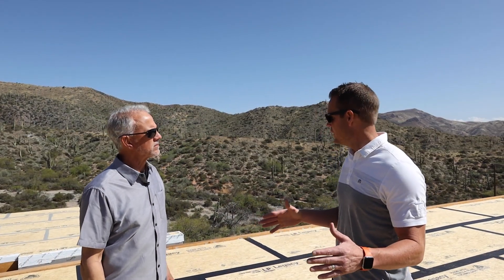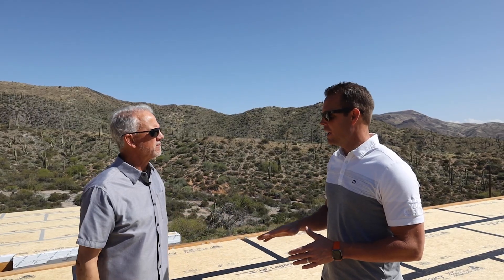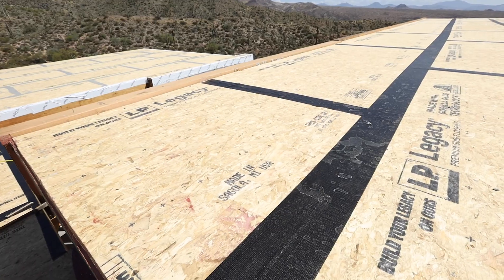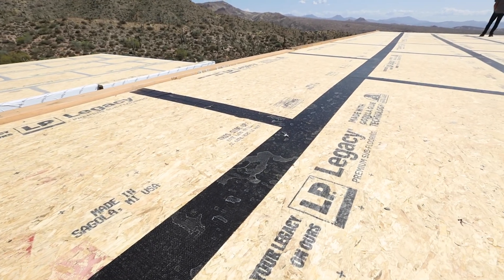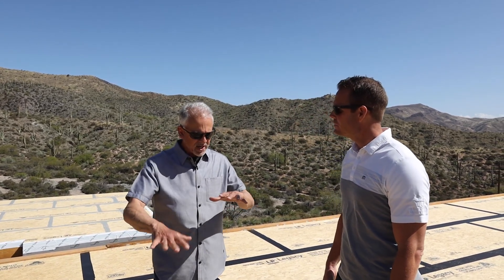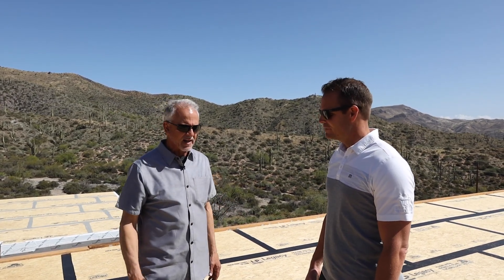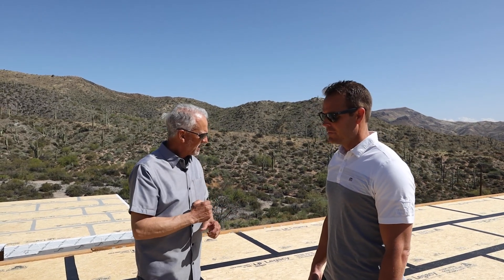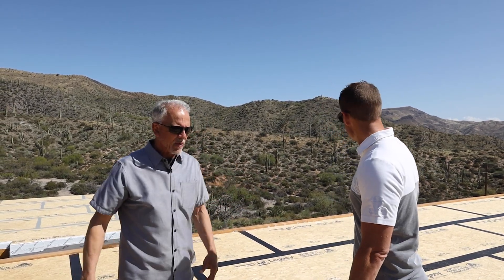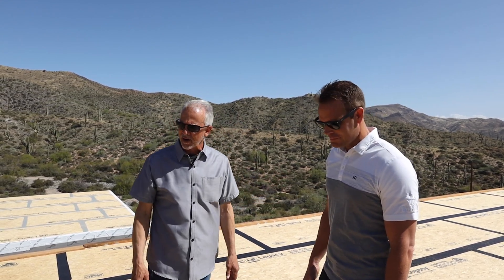Now we're on the other portion, the higher roof here, and you can see we had the gray waterproof membrane down below, which is a fluid applied. And here we have the tape. The tape is an acrylic based tape — very aggressive. In most of the applications I actually sprayed a primer on some of it to check the difference between a primer and just putting the acrylic down. The tape held up beautifully. You do have to roll it and really engage the adhesive. While we did some pressure washing up here of the ICF wall, the water sat on top and we just broomed it off — it acted like a roof membrane.